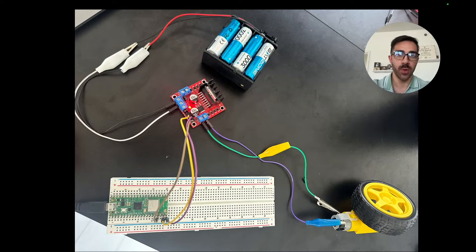First, let's talk about the components we are using today. First is a battery pack that holds eight 1.5-volt batteries for a total of 12 volts — make sure you get a battery pack like this with at least eight 1.5-volt batteries. I am using rechargeable ones. What's nice about this battery pack is it provides 12 volts. A lot of standard battery packs that come with robot kits only provide six volts, holding four batteries, and that's typically not enough to actually move a robot in practice.